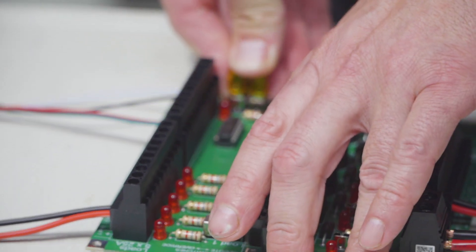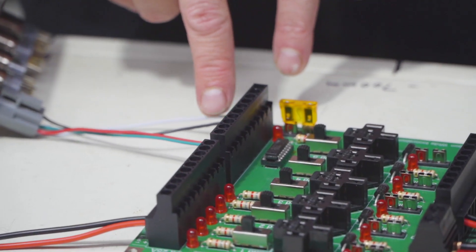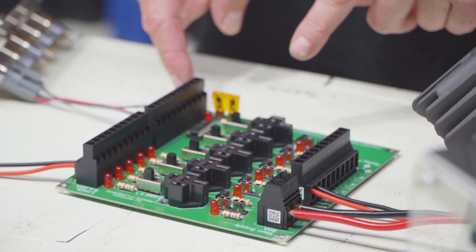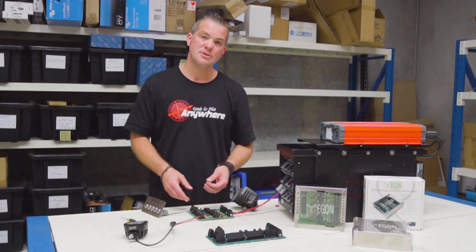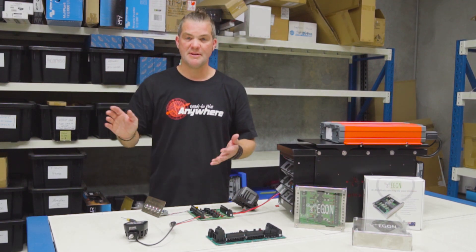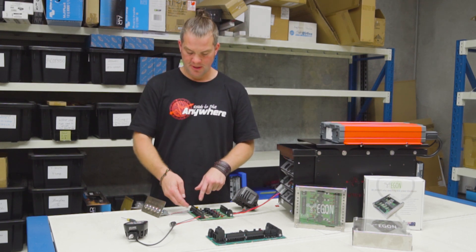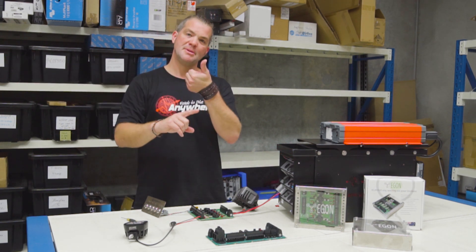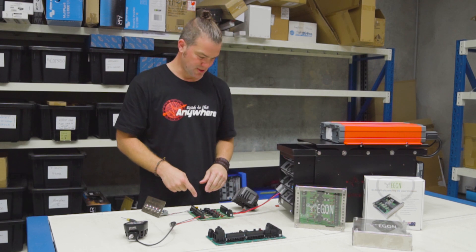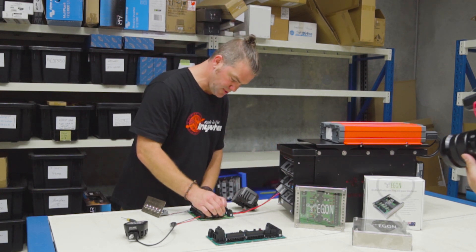To make these switches work, I'll add a 3 amp fuse into the bottom fuse holder. This fuse holder is responsible for power coming out of the two connectors here, which can supply power to your whole switch bank. There are only seven cables needed — we've done it that way so you can use seven-core cable like normal trailer cable to run to your switches. Seven-core cable is usually available everywhere auto electrics are done. One cable is positive, one is negative, and you've got five returns for the five switching circuits.